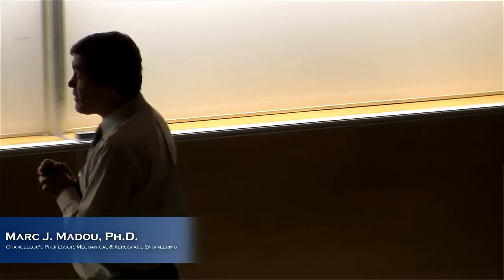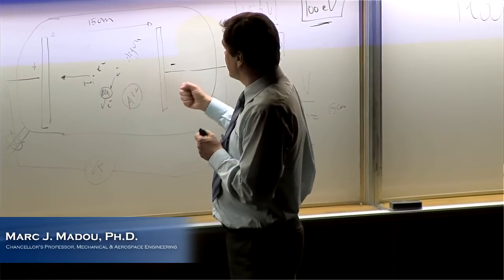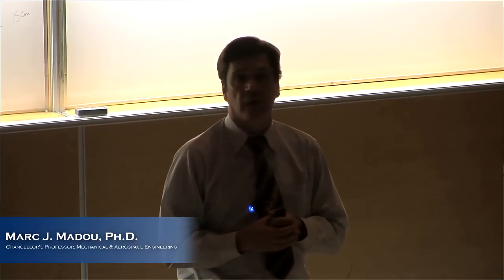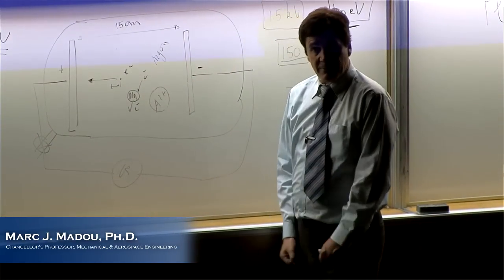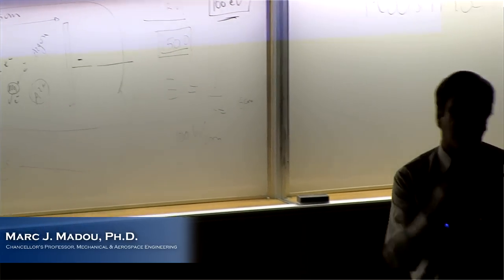Now I actually give you an important additional piece of information. I told you that the argon plus hits the cathode. And you know, it hits it damn good. It hits it hard. And hitting it etches it. And there is sputtering. So one of the most common processes you'll see in the clean room and in general practice of manufacturing is sputter cleaning. What is sputter cleaning? It's creating ions like argon plus to mechanically, because remember, it's a mechanical machining technique. Instead of a big tool, my tool is an ion, an argon ion. And that argon ion hits the surface and knocks off atoms.